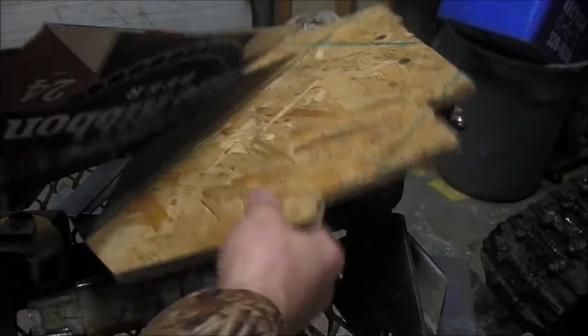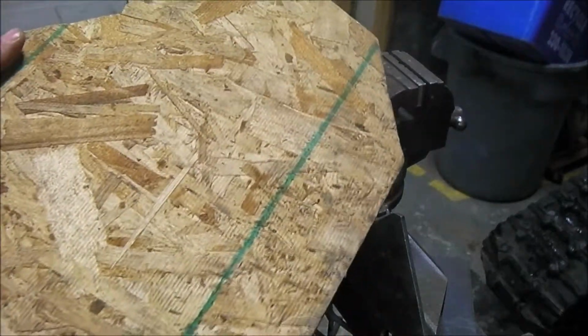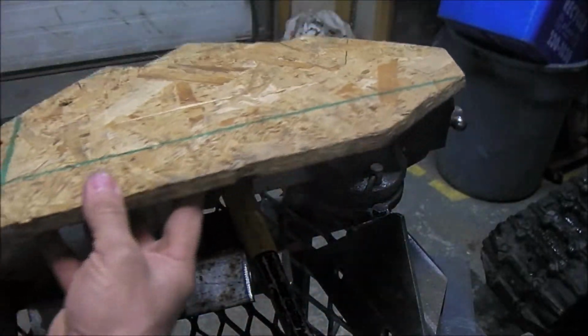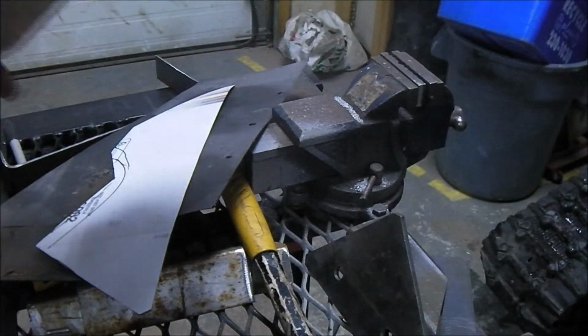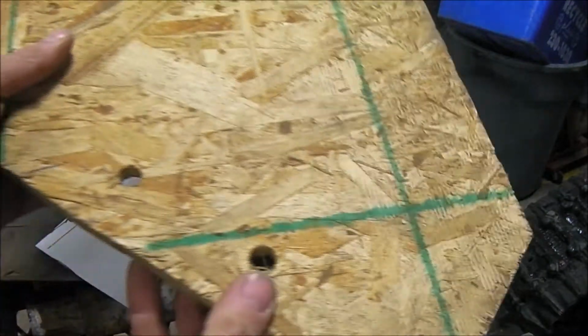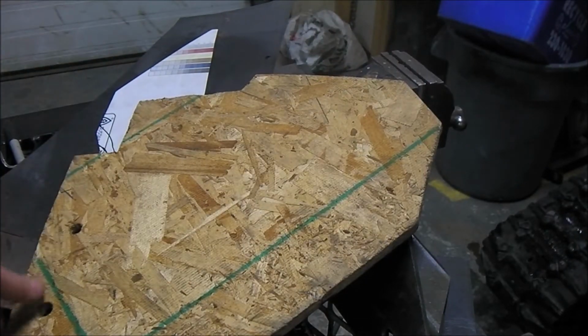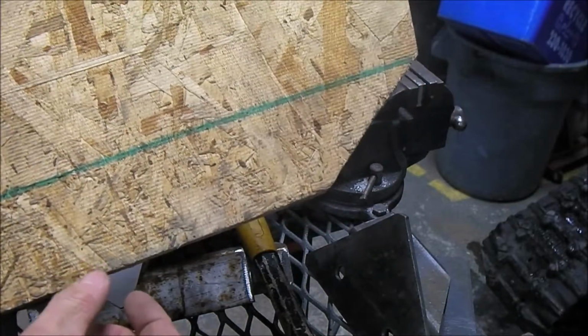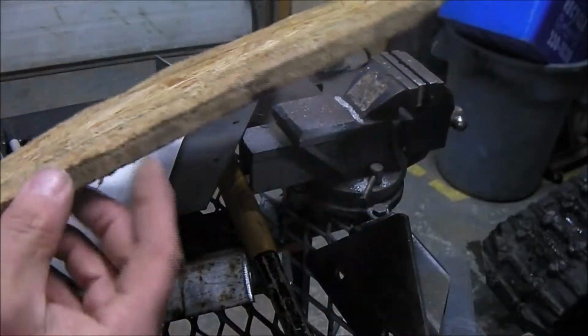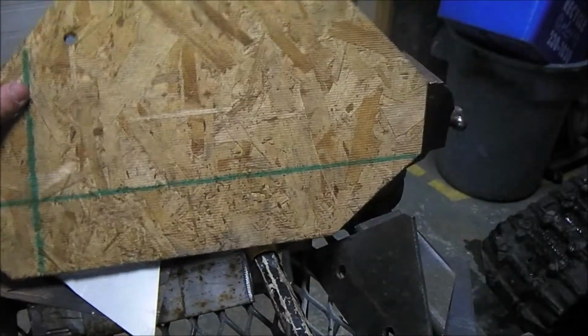And this piece here is for the main pieces, all the 4 main pieces. I've been using this 3/8 plywood, and I soak it in water, and I trace with the plasma cutter. When I trace around with the plasma cutter, it's actually 1/2 inch bigger all the way around because of the thickness of that wood. It works pretty good for me anyway, but it makes this piece 1/2 inch bigger all the way around.